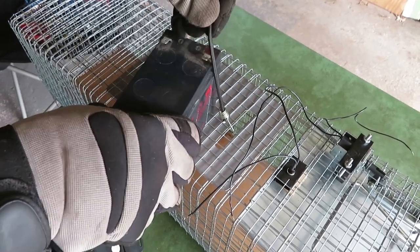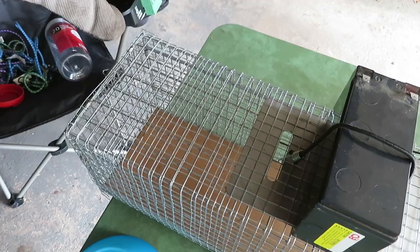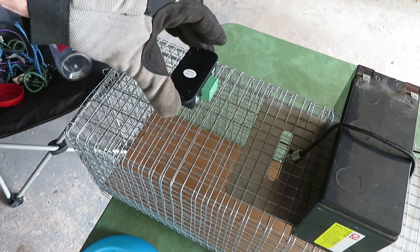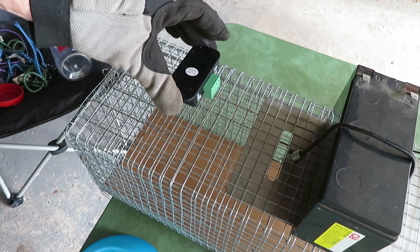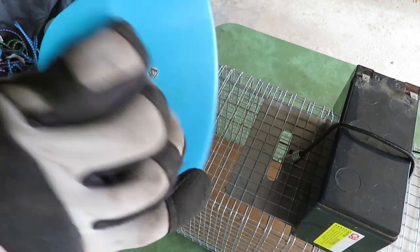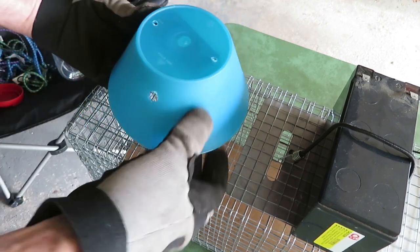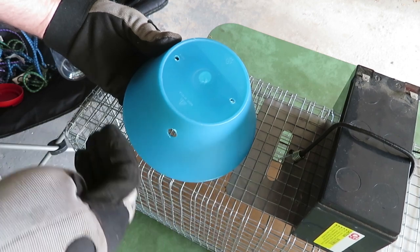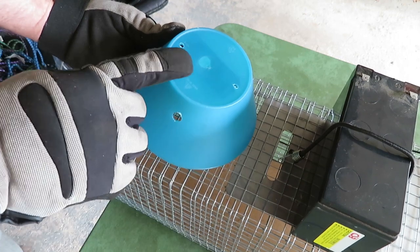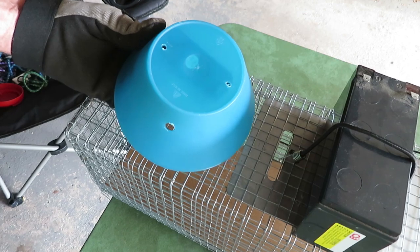The battery we're going to slip right in here in the middle and hold it down with a bungee cord. Here's the device that makes it all possible — the passive infrared sensor, PIR. This has to sit above the mesh by about three inches, which I discovered through trial and error. What I've devised is to put it on the underside of a bowl, which sets it up about the right height and also provides a kind of cone to prevent false activation. I drilled a couple of holes in the bowl — a hole for the wiring — and now we'll install it.